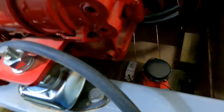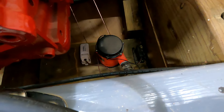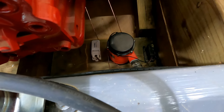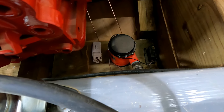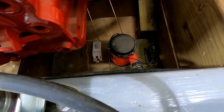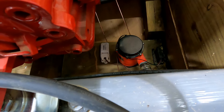One concern I had was the bilge pump here. You really kind of need a bilge pump in this area - this is the most likely area for water to come in. So you really want a bilge pump here, but you don't want to be pumping oil or fuel leaks out of the boat into the ocean or lake or whatever body of water you're on.